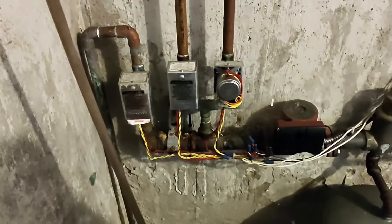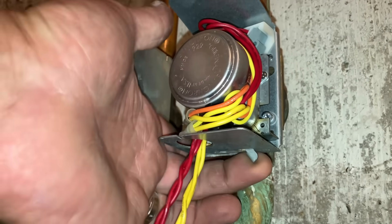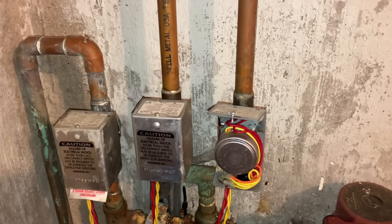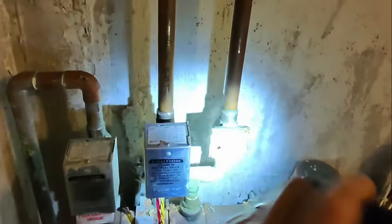These are closed and I have the valve shut off over there. The manual open valve isn't really doing anything but these are closed with resistance. The other ones are leaking — they're okay but that one is pretty jacked up. We're almost done draining down. I'm going to get creative with the angle grinder — I'm gonna try to cut right there and pop this one out. That one is not gonna come out, but if I can at least loosen up the others... it's airlocked.